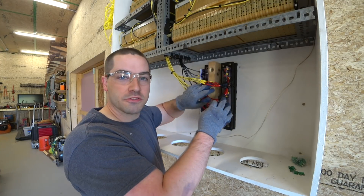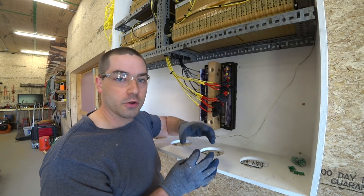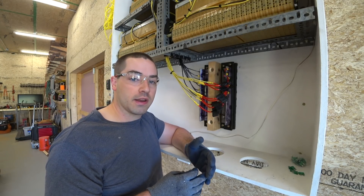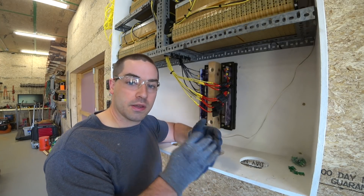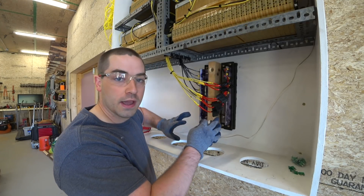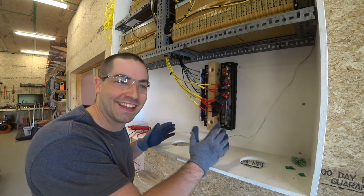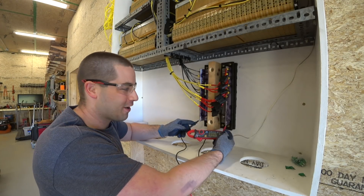If anybody's interested why I'm doing all individual fuses instead of one fuse block — which would have made this much neater — I wanted to, but I looked into it and couldn't find one rated up to around 60 volts with a thick enough bus bar built in. They were all meant for 100 or 150 amps. This way I'm going to get 240 amps out of this setup. All the fuses are in — nothing blew up. Excellent. We've got 44.2 volts right here at the bus bar.